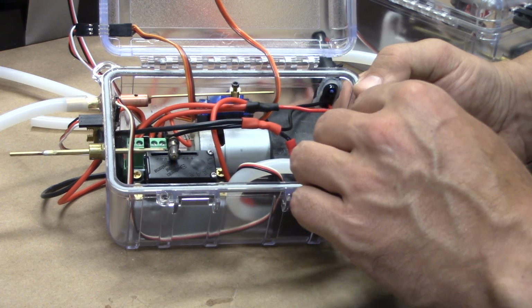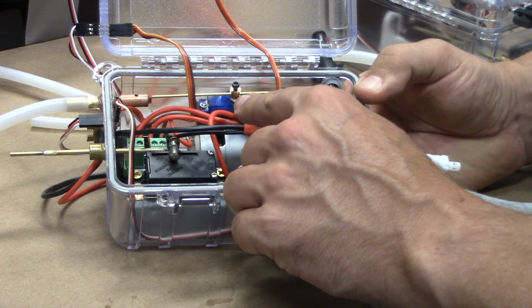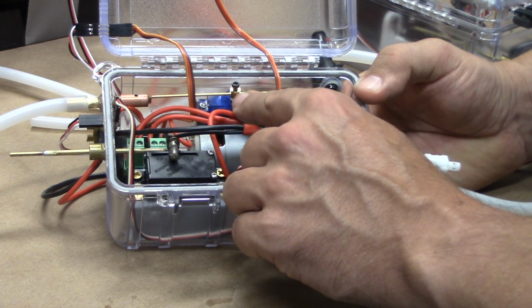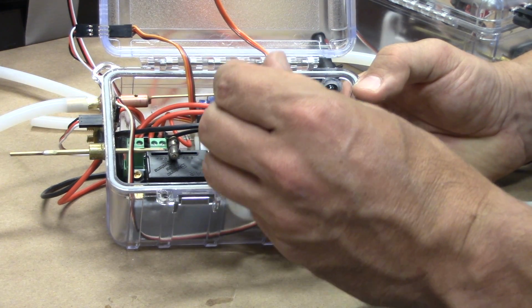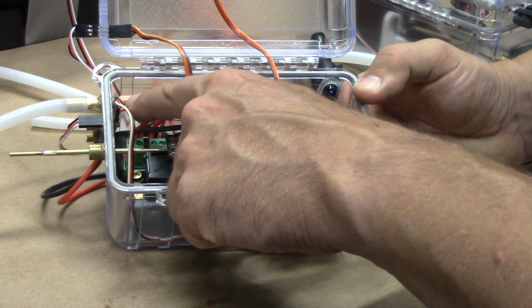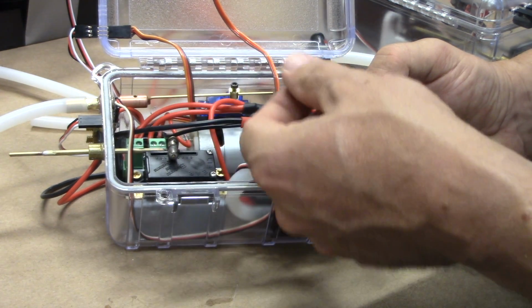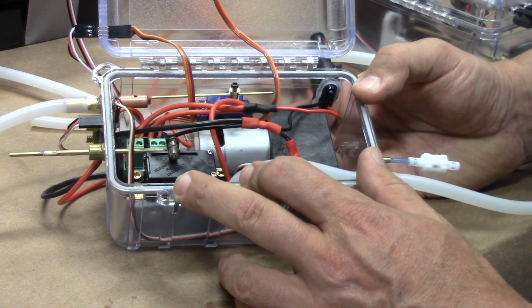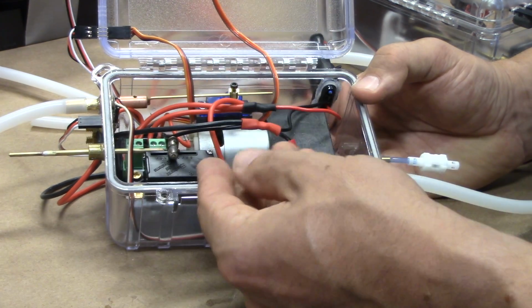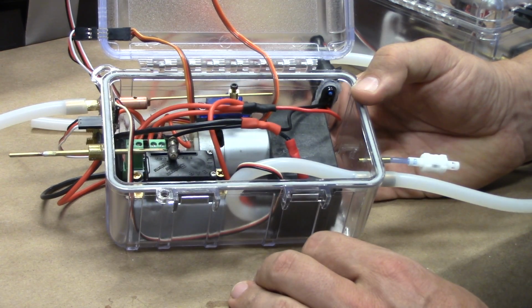And then the last thing is that equalization valve that I talked about, and this is servo actuated, just a small servo here right now, and I've adjusted the transmitter control so the throw is just minuscule, just enough to depress this tire valve, this Schrader valve on the end here. So I've got a sleeve that goes around, keeps everything centralized. Inside I've got a pin that depresses the Schrader valve, and basically that is how the entire thing equalizes pressure, draws air through this hose, through the snorkel hose, into the main chamber.